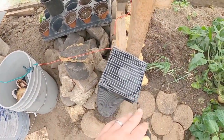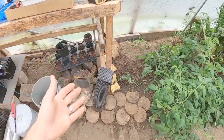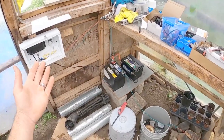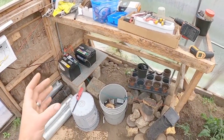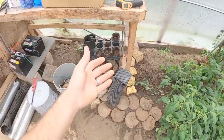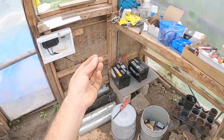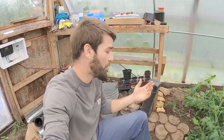This fan will be on 15 minutes, off 15 minutes, and continue that cycle until it runs out of juice. Hopefully the four 25-watt solar panels — built for cloudy days — will pick up enough energy to store in the two batteries and run this consistently through the night without any faults on our energy system. I want to add more batteries to this. Right now it's haphazard wiring — I'll get it hardwired to the timer directly, maybe using alligator clips kept dry and protected.